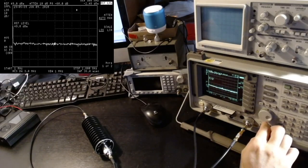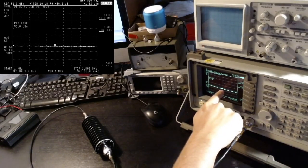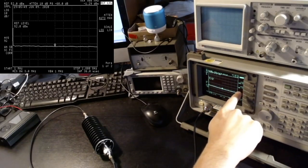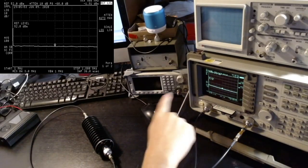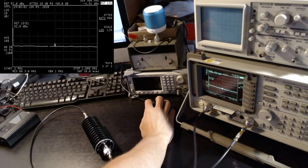Okay, so now I can basically move my reference much lower. And we will be able to see, now that we connect the HackRF and the amplifier, the signal automatically calculated. So we will be able to measure without doing any minus 60 calculations on the fly. We will see what is the power emitted by the HackRF with the amplifier. So let me now do that.